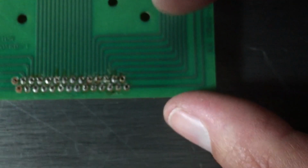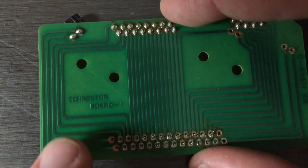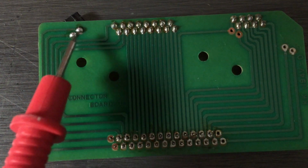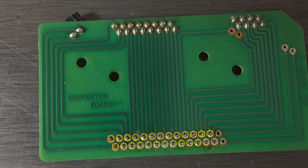So now that we've moved the connector over to the left, as you can see, to the 2 pins on the far left, you will notice that the lead leads around to the new connection where the aftertouch ribbon connects to the connector board. Those 2 points come around to these 2 points. Now comes the more difficult task of trying to solder these 26 points successfully without any of the solder joints touching each other. So wish me luck.